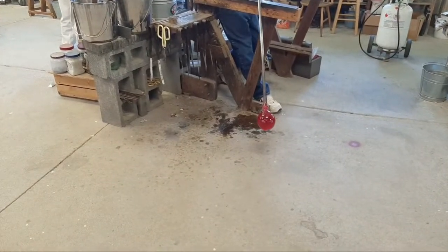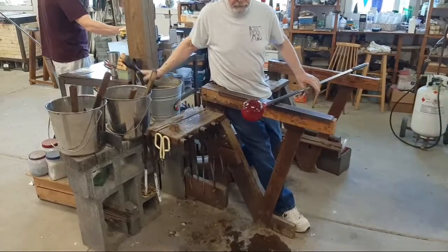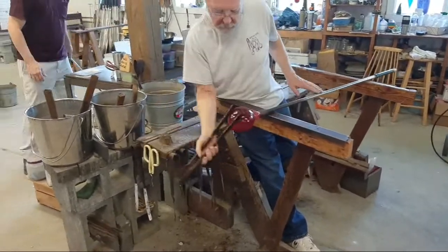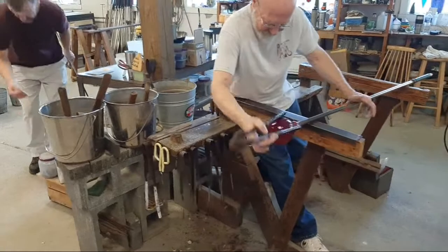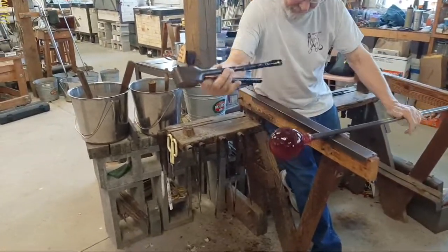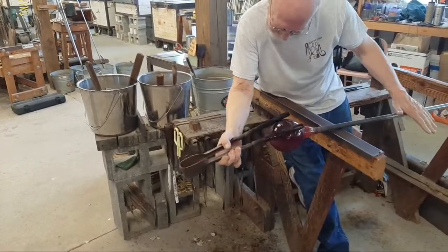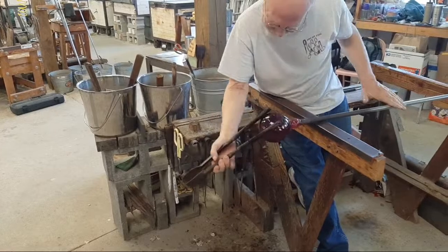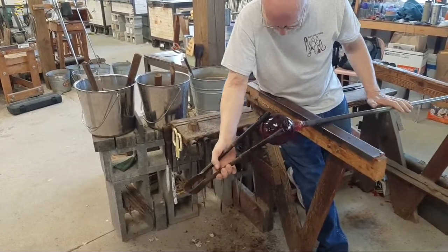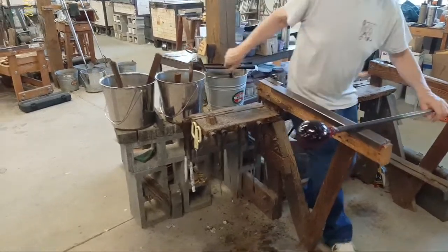And the inflation takes place mostly from the midpoint upward toward the blowpipe. So again, we make the pieces by creating a sphere with a jack line in it, and also we work the bottom half of the vessel, which is outward from the blowpipe first, then we transfer it. Right now he's chilling and shaping with a pair of what we call paper pegs. They're cardboard jack blades, basically.